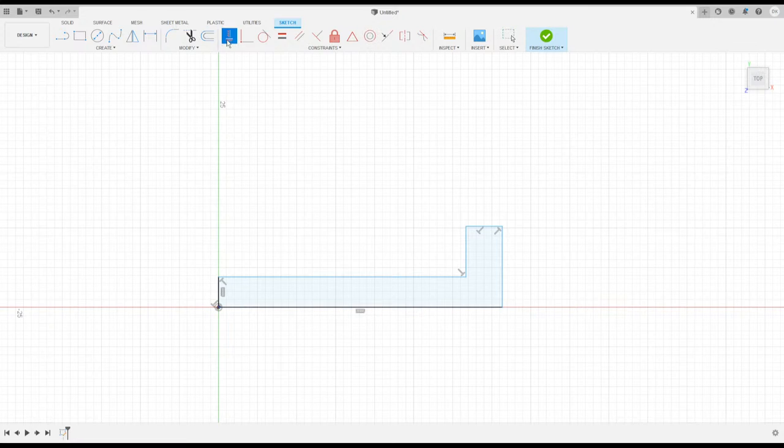No, horizontal. All right, that's horizontal. This is going to be vertical. Okay, I have that as a right angle, so I don't need that to be horizontal. I already have this coincident. Yeah, I'm trying to make a freezer door handle. This is a side view of it. Oh, rather, it's the top view looking down, because it's going to be printed vertically. I'm just trying to get a rough sketch in here first. I'm going to dimension it right now. So, let's call this dimension. See, it has to be able to fit underneath the refrigerator door.